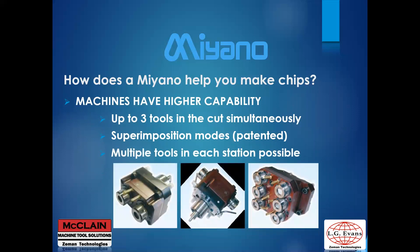It's totally possible to have more than one live tool or turning tool on the same turret location. This means a 12-station turret may have 20 or more tools on it, so a three-turret machine could easily have 60 tools or more. This may allow for running families of parts with absolutely no changeovers. The tool shown in the bottom right has six live stations — if used in every station you would have 216 live tools in the machine, though not likely, it is possible.